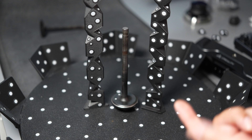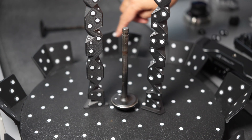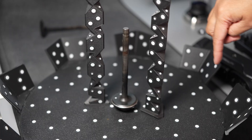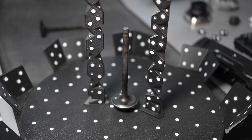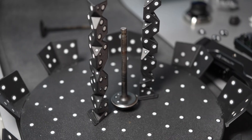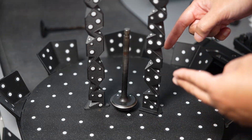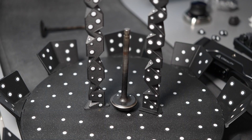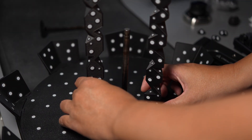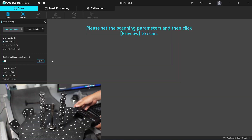The scanner will track this tower instead of markers that are very far away. Closer markers to the object means higher precision — the rule is simple. The scanning tower has a triangle shape so it won't block the valve stem when scanning. I'll place it just a little bit here and use 0.2 for the resolution.